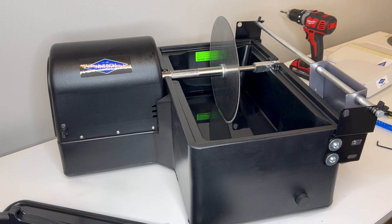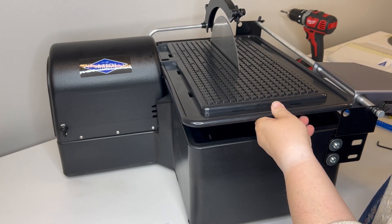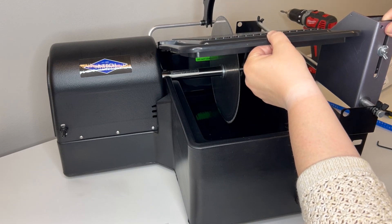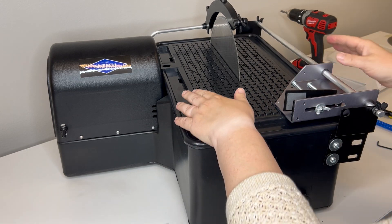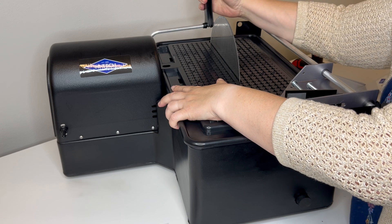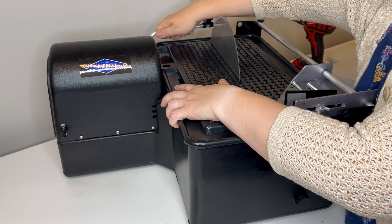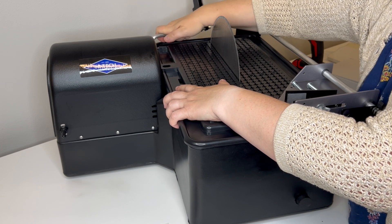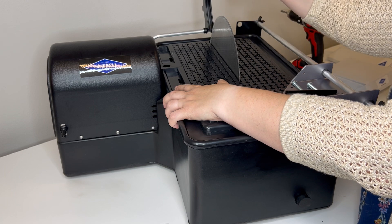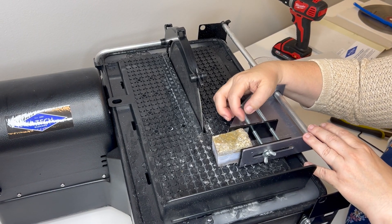If you put in a little too much, just take some back out, then replace the table. It can be a little tricky to get the table off while this is on, but if you lift it up it'll come out no problem. One other thing to cover is the blade guard — you can make adjustments left or right to get the best center. If you're getting a lot of water coming out the back, you can lower it down, which will sit it further down in the back and reduce water splashback.